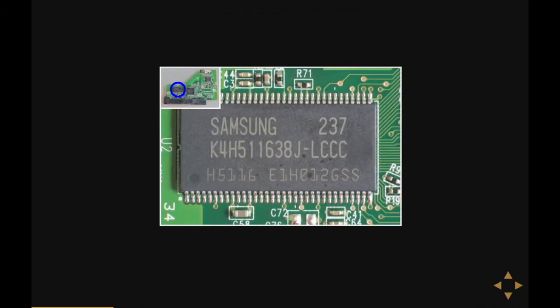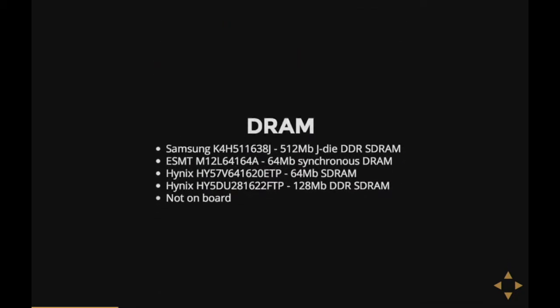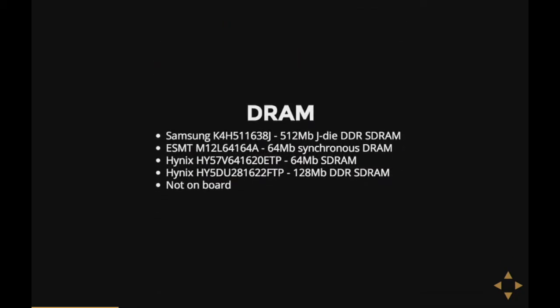First of all, there's this one, and you'll probably recognize it if you've ever built a PC, because it's a bog-standard RAM chip. It's either SDRAM or DDRAM and comes in a few different flavors — basically a jelly bean part. Just throw the type number into the internet and you'll get a nice datasheet. They're just bits of RAM ranging from 64 megabytes down to 8 megabytes, and they're usually always the same as the cache size advertised on the hard disk.